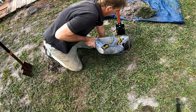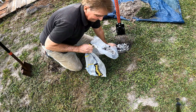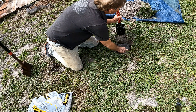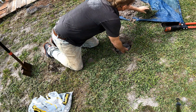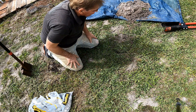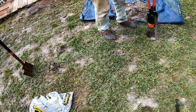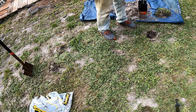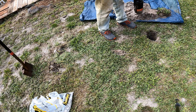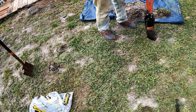We're going to fill this up with gravel — inch-and-a-half crushed washed stone. You can find it at Lowe's or Home Depot, about $5 a bag. Bring the gravel all the way to grade, fold the fabric over, take your sod and put it back on top. Now we're ready to test vertical drainage. I'm going to dig one more hole — I'm not going to cut sod this time, just use the post hole diggers. We want to get down to the hard pan.